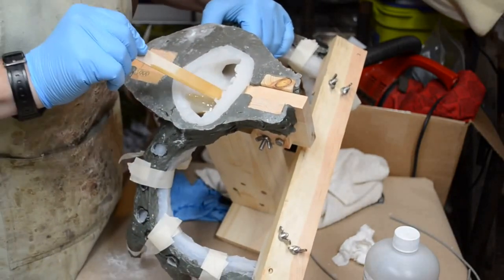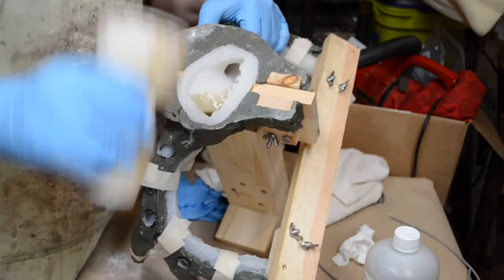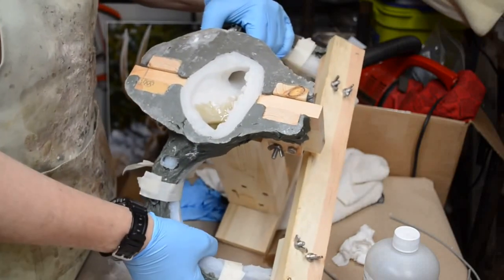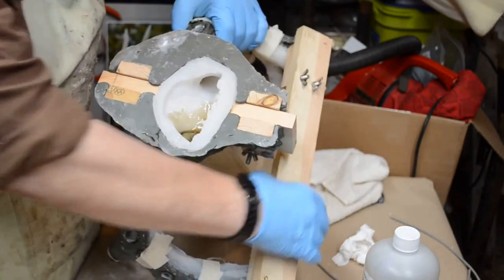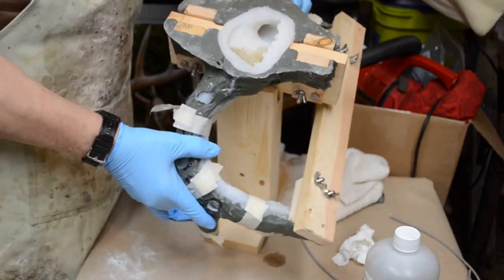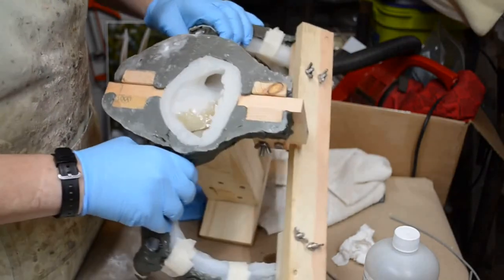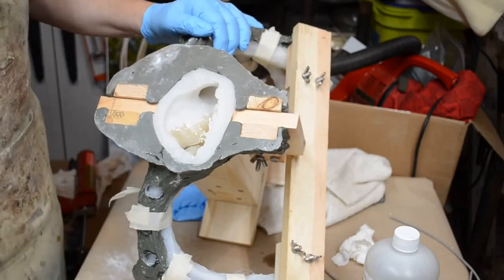Bubble that needs to be burst here on the surface of the skull plate. Don't want that there. All right, it's starting to gel up. It's gelling up beautifully. Beginning to thicken. Beginning to go through a heat cycle. Okay. Now the resin is starting to kick. How well you can see that starting to kick. Now while it's gelling, you do not disturb it. Let it rest like so. Let it rest on its tines. Just hold it for a bit. I'm not going to worry about a wire. This is good the way it is.